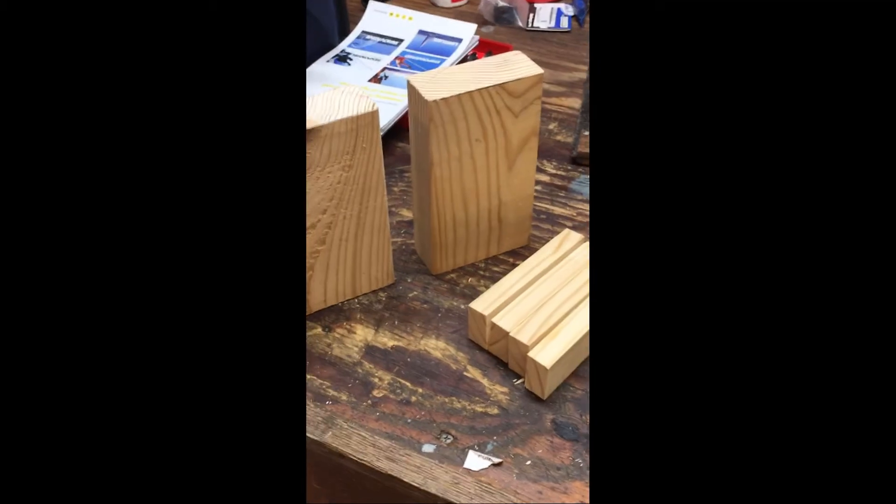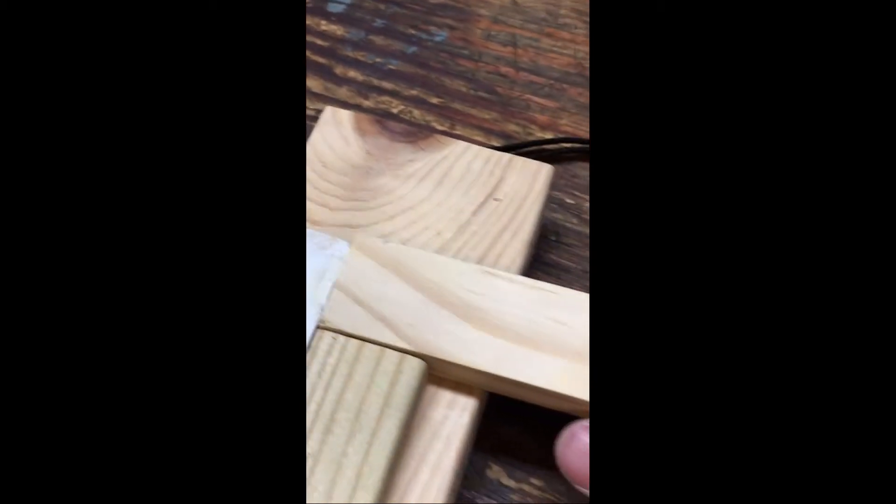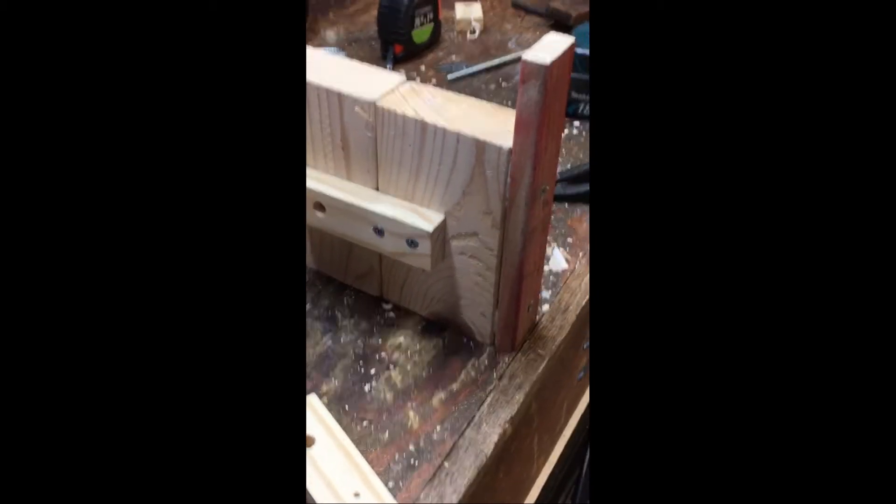Here we are making some mounts for my winch, just using stuff I have laying around — most of the stores are closed at this point. Made some blocks with two-by-fours and some little stringer strips. Basically, this block is the mount for my winch; I'm going to mount these little pieces on the side, the support bar falls into here, then I use little supports to tie these together with a bolt on one end. I'm not a big fan of working with wood — I always make mistakes — so I made a little template using two pieces of scrap so I get each one exactly the same. Pretty idiot-proof; I can drill a couple of holes and put these together.